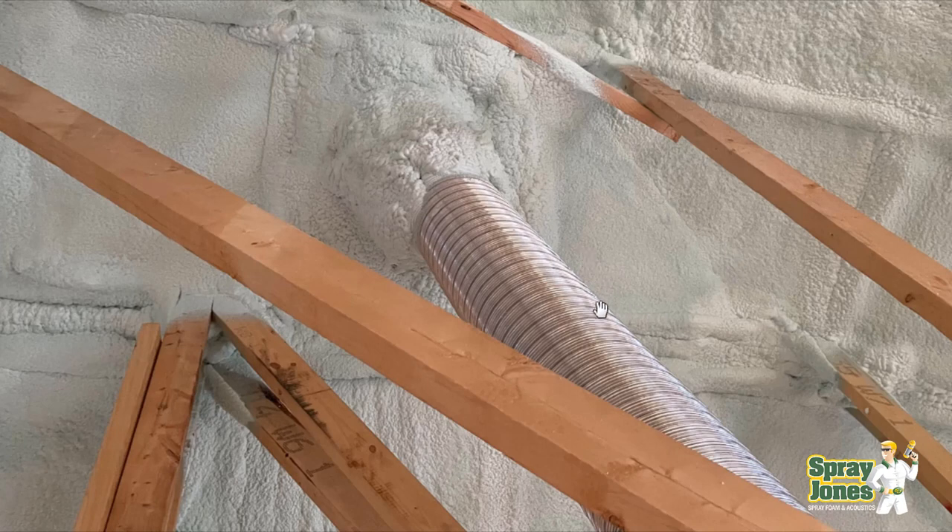That way the cold air dropping down the stack pipe isn't going to frost up and condense the outside of that jacket in cold climates. I have this done in my own house and the outer jacket never gets above 100°F. Residential ducting is rated all the way up to 120°F and we've got spray foam approved for that. This is the only sensible way — even though we don't have white paper data. Spray foam guys, fireplace guys, Roxul — nobody wants to take authority over this. This is truly an orphan.